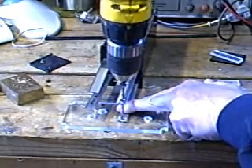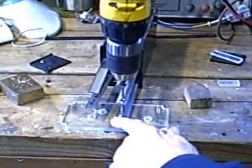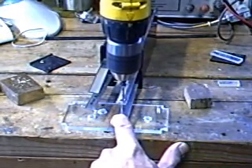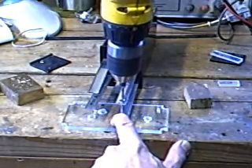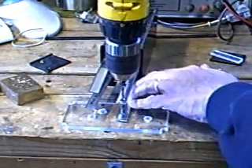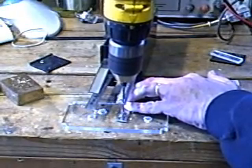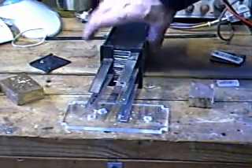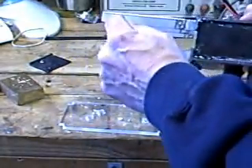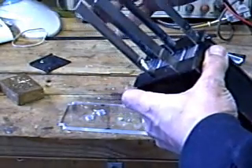I'll drill my pilot hole, and I can see that as I create the pilot hole, my drill bit is centered down through the quarter-inch holes that it extends through — so that's a good thing. It sounds like my battery is going to die. At least I got the pilot hole drilled through, and I'll just finish the hole going through the other way. They should line up reasonably well where I can take my threaded rod and just go right through and bolt them all together. I'll show the completed assembly in just a minute.